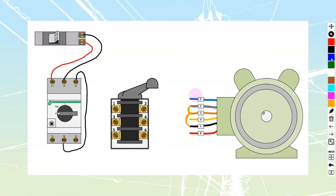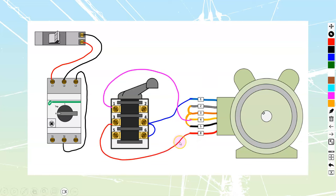At the motor, we start by junctioning terminals 2, 3, and 5 together with one wire nut inside the motor — we aren't taking those leads out. Then we take lead number 1 and run it across to drum switch terminal number 4. Terminal 4 gets a jumper down to terminal number 6. Then we take motor terminal number 4 and run it across to drum switch terminal number 1. Finally, motor terminal number 8 goes into drum switch terminal number 3.